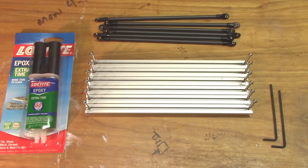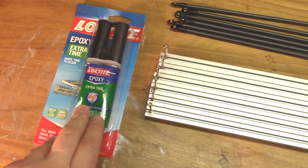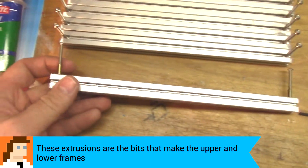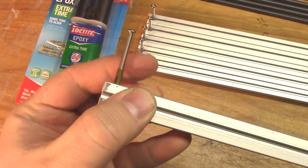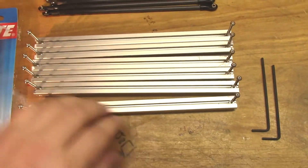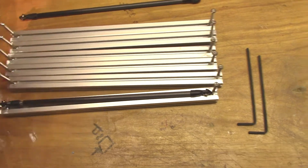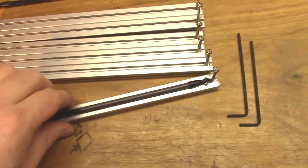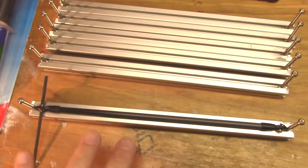Here's the rig for the diagonal arms we're going to be putting together. We're going to be using some slow-set epoxy to give us plenty of time to work with it. These are just parts — the aluminum extrusions — what we've done there is just throw on one of the hex screws and we've got a 10 millimeter piece of brass here. That's going to take each rod after we glue and just make sure we have even pressure on both sides. Then we're going to drive these hex keys through the ends when everything is said and done, which should help everything line up.